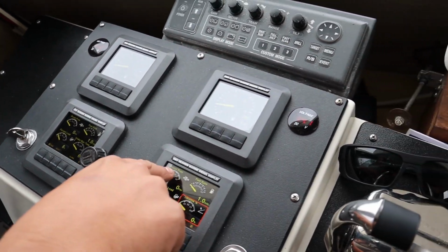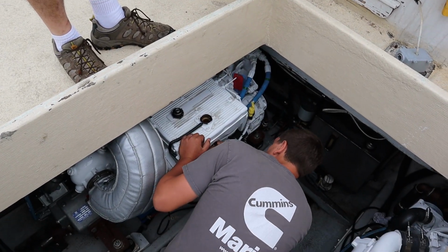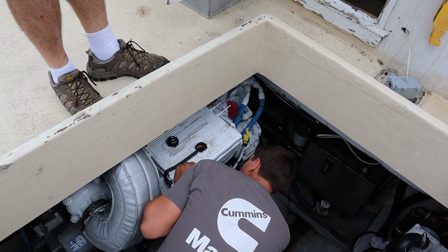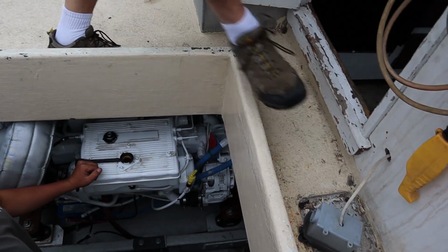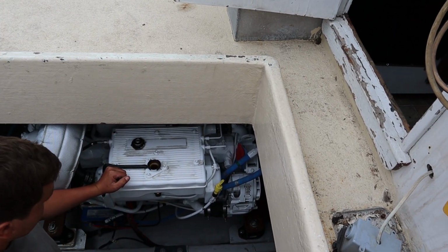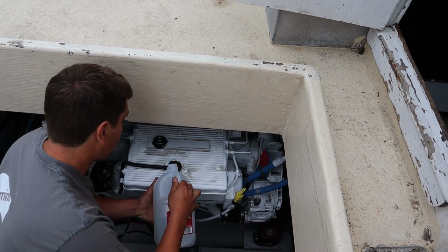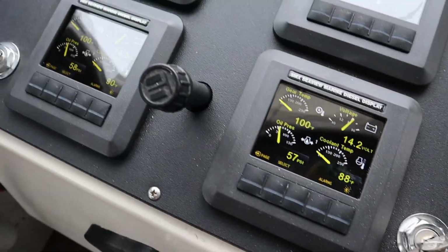Still have a stern light on. Low coolant alarm, huh? Probably just circulating through. No, you can see it's full. Is it full? Yeah, I see it, but I could do with another inch. Here, there's some distilled water. That sensor's pretty high and they're pretty sensitive. All right, that took care of the coolant alarms.